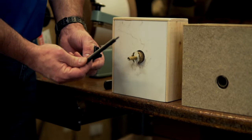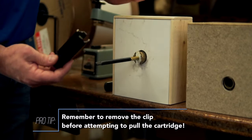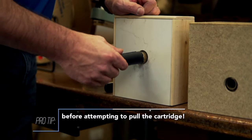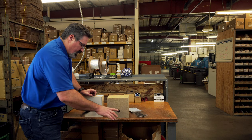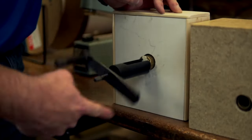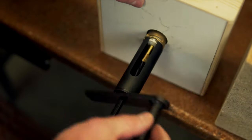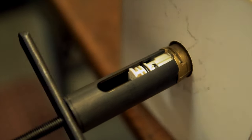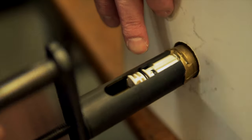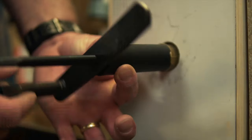So just like before with the 1200, we screw the threaded rod into the cartridge, put the tube over the top, and screw the crank down until it gets close to the tube. And then once that's seated up against the tube and the tube's seated up against the valve body, we can crank and make sure that the PosiTemp cartridge is riding up inside that tube. This is going to remove that whole entire cartridge easily and smoothly.